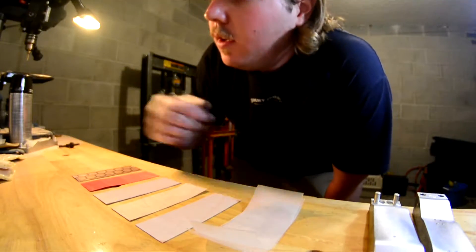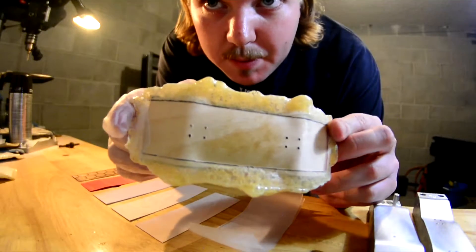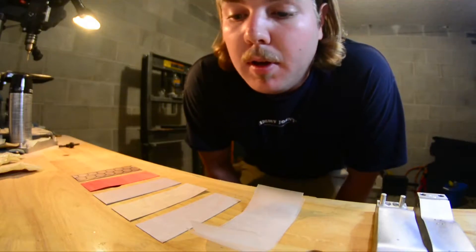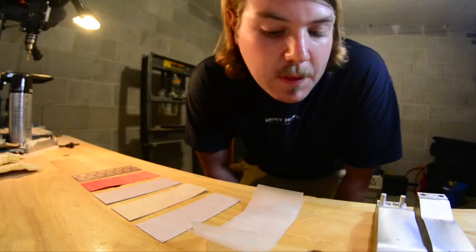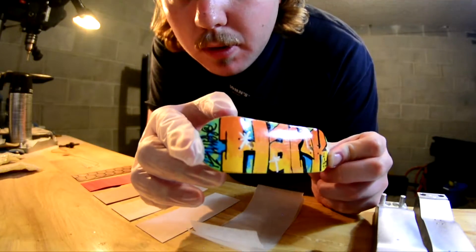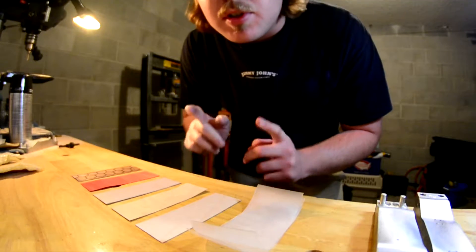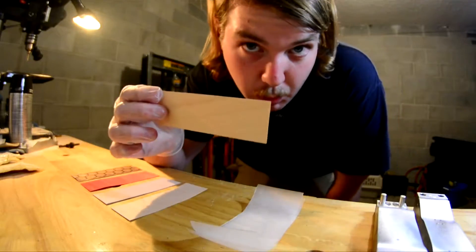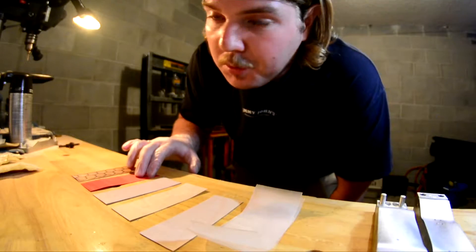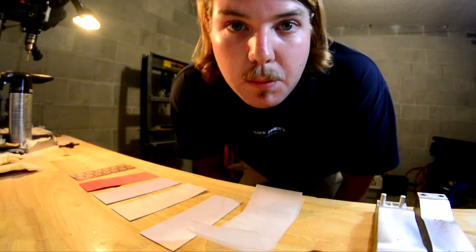Back out in the garage here — gone ahead and taken out our deck from the mold from the last video. Looking pretty good, got the holes tapped in there and the lines drawn up, so that one is going to join the other one. Those are just put off to the side — I'm probably gonna get like four or five of these done before I shape them all up. We also have our first graffiti deck with the second coat of clear coat down, looking pretty good so far. Gonna wet sand this thing again and then get the third coat laid down. But first, this deck is going to be a maple, maple, maple with a little bit of red and then some African mahogany with our honeycomb print on top. I'm going to grab some glue, get that laid down, and then get this thing thrown in the mold.